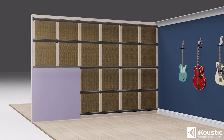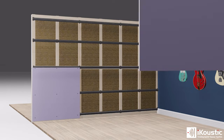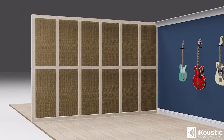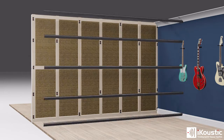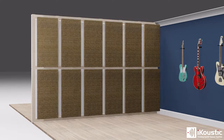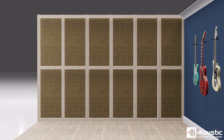When we use a system like the one on the desk here, we are adding a sufficient amount of mass to be able to insulate you — it reflects airborne noise and prevents sound leaving your room, but also prevents sound getting in. We use a mute clip and channel system here, which creates a physical gap between your original wall and the new soundproofing panels, making it far harder for sound to get through your wall and radiate out the other side. Inside the cavity, we would use acoustic grade mineral wool of 45 kilograms per meter cubed or higher.